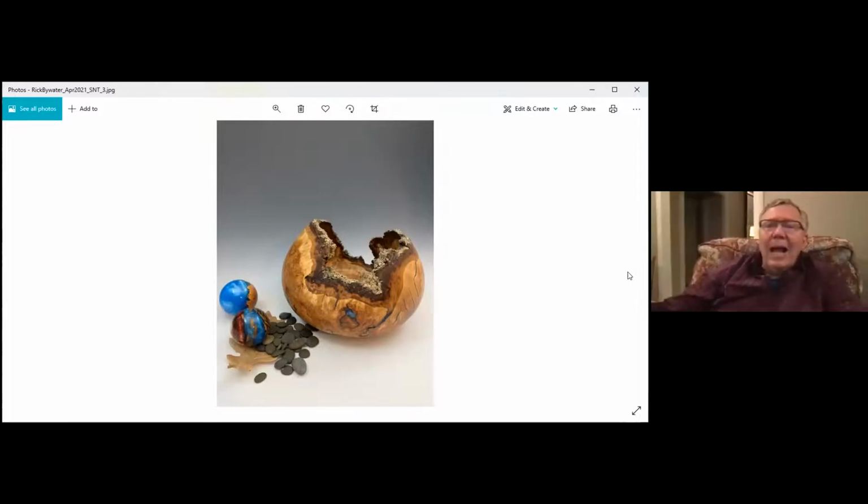Well, what I had to do on that piece, Mike, was I'm going to call them selective pours. Up until now, I've always done a total immersion of wood into resin. Well, I didn't want resin in my bark. That would have looked terrible. So by turning it upside down and building a dam, I was able to first pour around where the chuck was going to hold the piece. And once that was done, I was able to then turn that away.